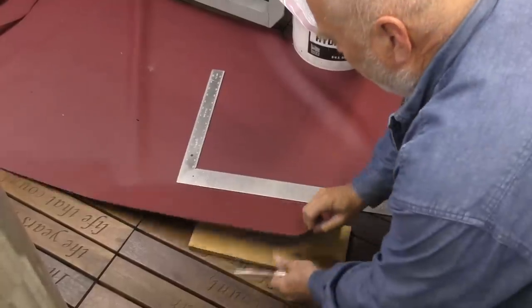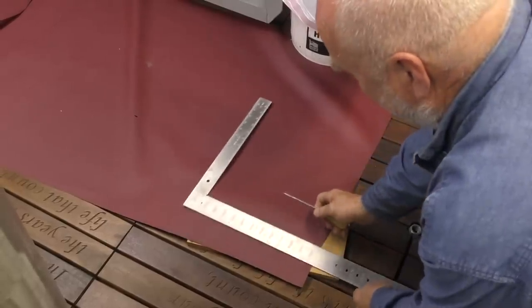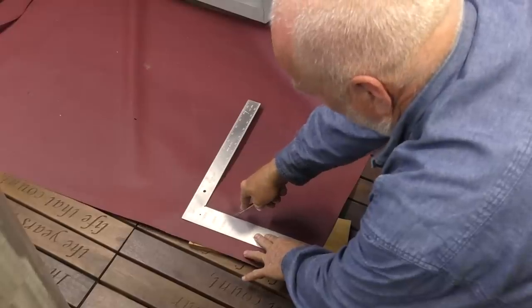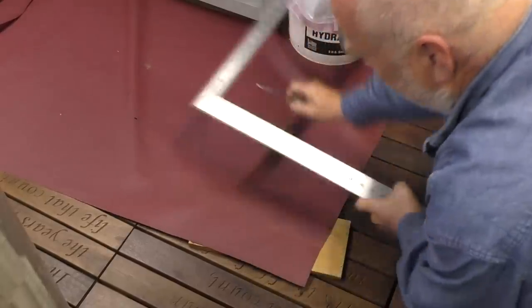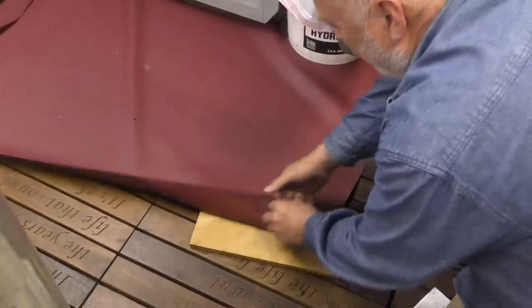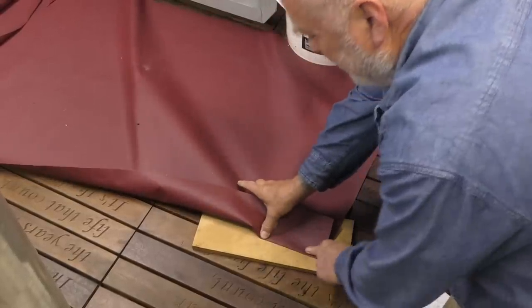And one of the steps while we're making this thing is this device. There's a whole video where you can see us making these sails, but this is literally a technique to get a fold in this stuff. You take this awl or ice pick and press down as hard as you can and drag it along in a straight line. That's what it does. It kind of impresses into the plastic there. So now that makes it easier to fold that over and create a seam.